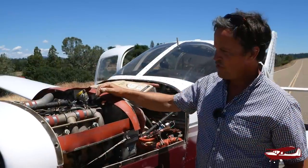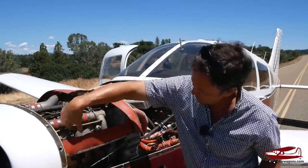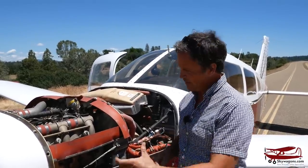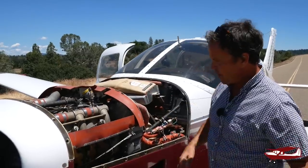So, more detail on the engine. We've been through all the intercooling and the wastegates. The oil cooler is here, so the air comes in under the cowling and it's forced out the bottom of it here. The air gets forced in a lot of places in here. Forced through the oil cooler, forced into the induction system for the intercooler, and then obviously out underneath.